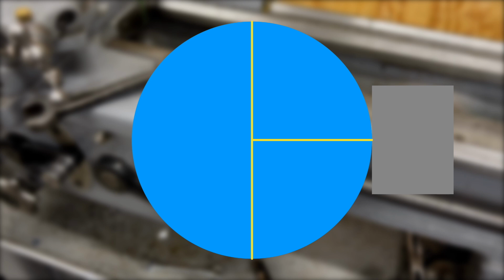And the horizontal one is representing the radius of the sphere at the center of the sphere around that rotational point. And if I were to take a look at different sections of the sphere using the same center point, you can see the length of that line gets smaller and smaller. If I go back to my original illustration, you can see that that line there is representing the true radius of the sphere. If I were to rotate the pivot point, you can see here, if we zoom in, that the part of the sphere that's touching the lathe bed is no longer in the center and is no longer as long as it was before.